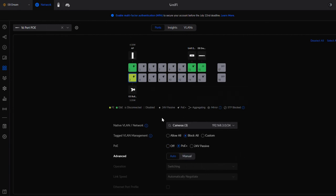That is what creates the physical security on your switch — very simple to do, but not intuitive if you didn't know to look there. As you add physically connected devices, maybe you have a kid's network and want to tie the port in their room to a kid's VLAN — come in here, choose the port, select the native VLAN, and make sure you say 'block all.' Where this doesn't apply is device-to-device connections, like router to switch, switch to switch, or switch to access point — in those cases you want multiple VLANs to be able to communicate.